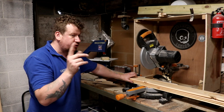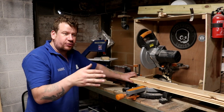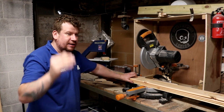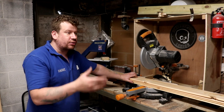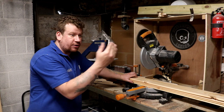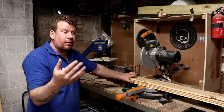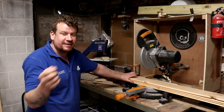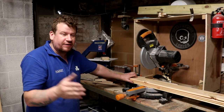I know 80% of it is going to be used just on circumnavigating those tanks. Once this is cut I'll set myself up with the drill and we'll go ahead and put all the pieces of matchboarding onto the tanks in one go. If there's anything that needs attention — like any cuts or any more insulation needs adding — then we'll leave that particular tank and start another tank, going as far as possible with all the tanks. Then we'll have got most of the matchboarding on and can come back and address all the little snagging list after the event.